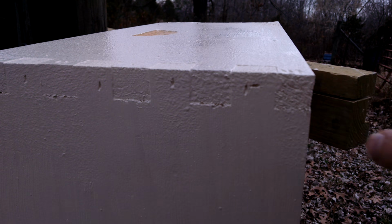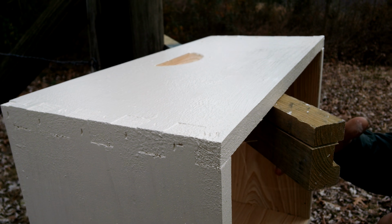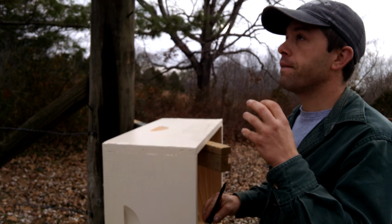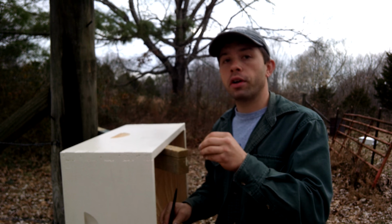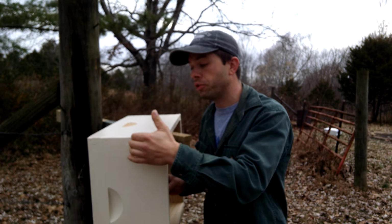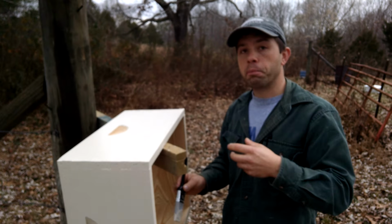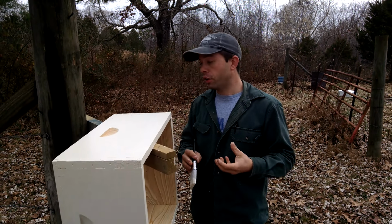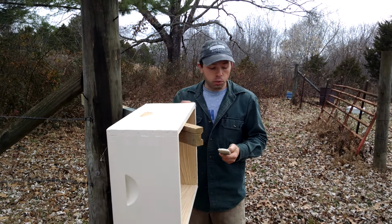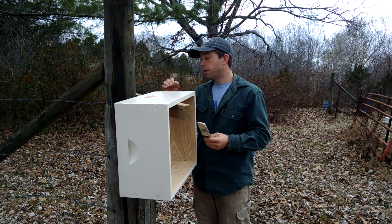Plus, this piece of equipment came from the Amish in Lawrenceburg, and while the equipment is good, it's not the most uniform, and the joints aren't as tight as some of the equipment that I've purchased in the past. So in between these fingers, there's going to be gaps, especially in this box. Now, if you get budget grade or something like that, you're going to experience that as well. You need to push down with your roller on those corners and make sure it soaks up in that end grain.